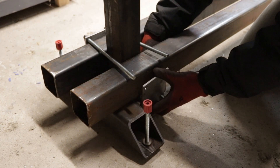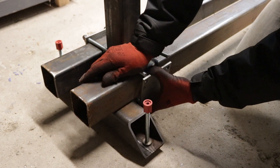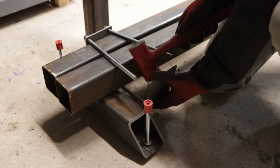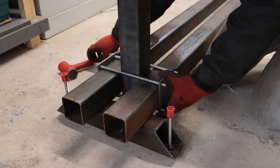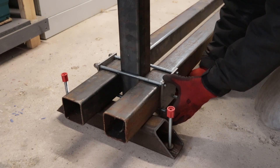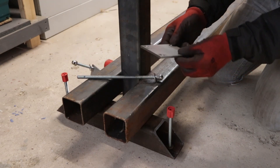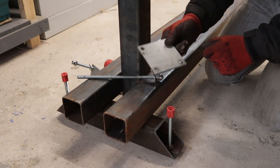It was at this point that I realised the tolerances were a little bit too tight. I played around with it for a little bit longer just to try and make a difference using a rubber mallet, but it just wasn't an easy fit, so I had to come up with another solution. As you can see, I've found a solution. It's still a little bit tight, but all I've done with all of these plates is drill out the holes - originally 10mm, I've just drilled them out to 11mm - so they fit a lot better now.